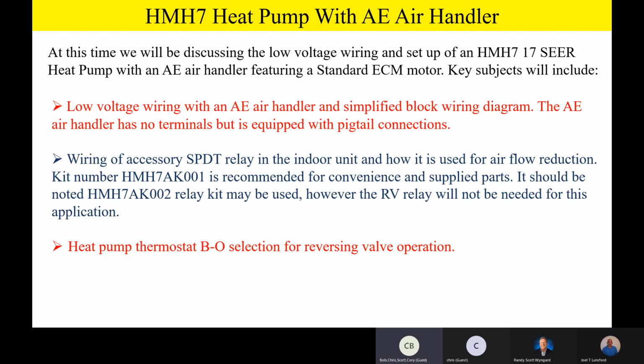Thanks. I was not aware of that on the other product. Yeah. So on all of our other Champion heat pump products, every other one, including commercial, we energize the reversing valve O terminal in the cooling mode of operation. This product here, we energize the B terminal, and energize the reversing valve in the heating mode. So there's the difference between it.